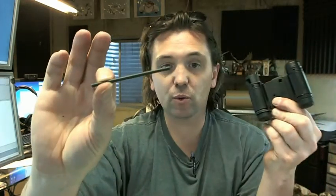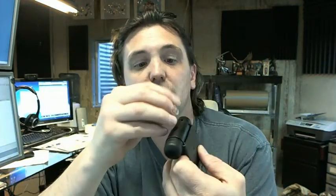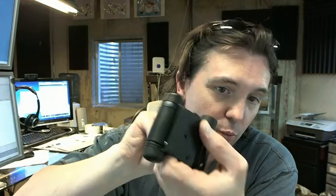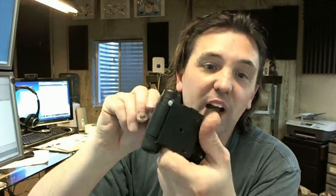You've got to mortise that leaf. Your tension is set by the tension rod that's going to be included — you'll insert that into the tension collar here, rotate it clockwise, very important. You can see that you reveal additional holes there. Then you'll insert the silver pin that's included into one of those holes. You can release your tension and you can see that it will stay there — now your leaf has some tension on it.